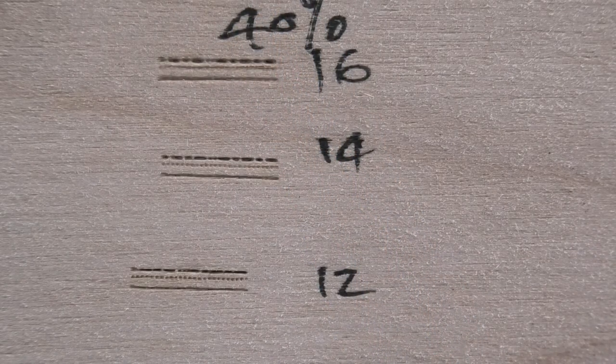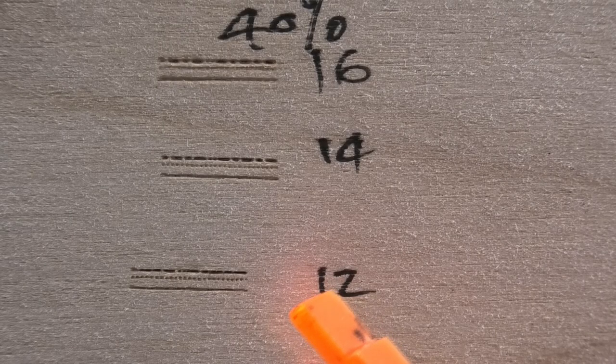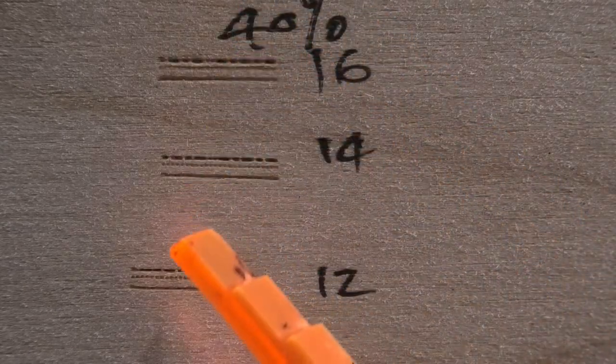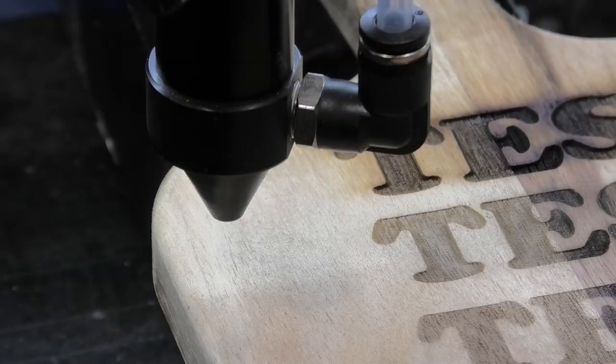Now remember, this is the wrong material. So we need to do this quick same test, 12 millimetres distance, 340 parameters on our acacia, because they may be different parameters. We'll set the origin there. And we'll run a test just here. And we'll also run a test here over into the white so that we can see the difference.